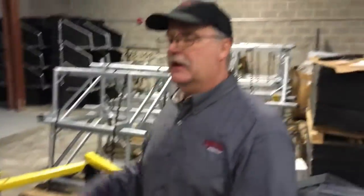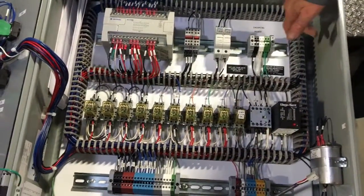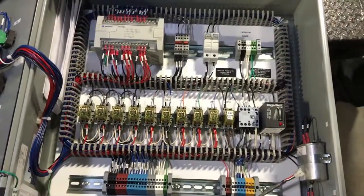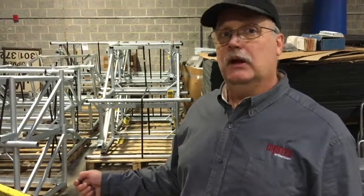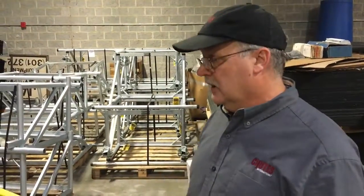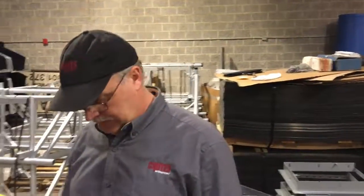Where this is mounted on the wall, where the control is mounted on the wall, where the power unit goes, where the sorter goes — it's all going to be in this drawing. Here is your input. This is a 120-volt input. I'm going to have a pigtail already attached to this. It's going to have a plug, a three-prong plug, just like any electrical piece or extension cord. You want to just plug it into the 120-volt outlet that will be supplied by others.